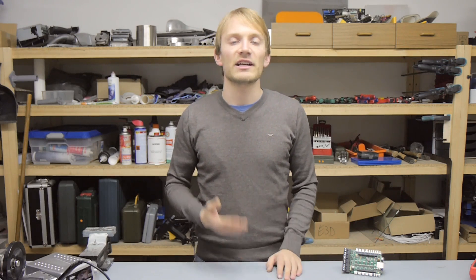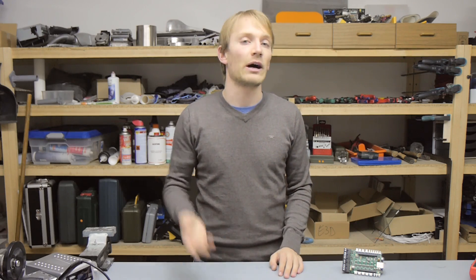Once things are set up, they do work. However, for a 3D printer, you won't — or at least shouldn't — try to get every last bit of speed out of the Replicape that it promises, or you will very likely end up with prints that look horrible when your entire printer starts resonating and shaking around. Basic functionality it is, and I won't go into the details of how insanely fast your 3D printer could theoretically move with the Replicape, because it doesn't matter.